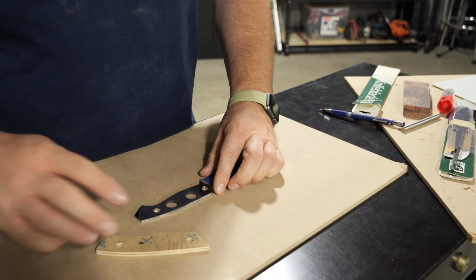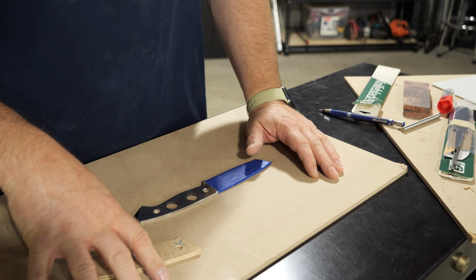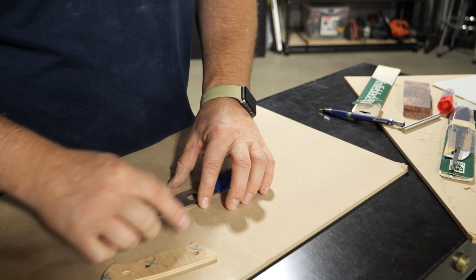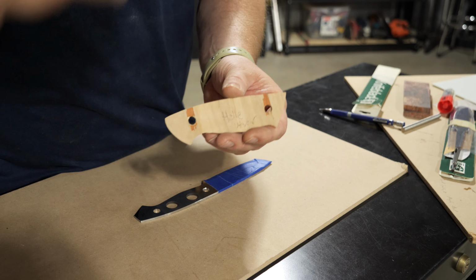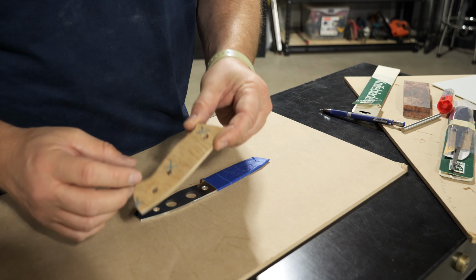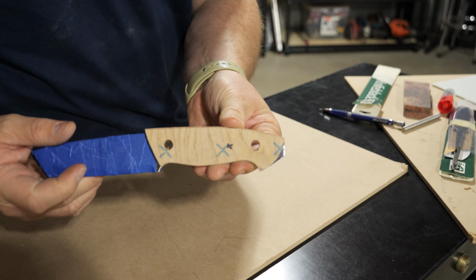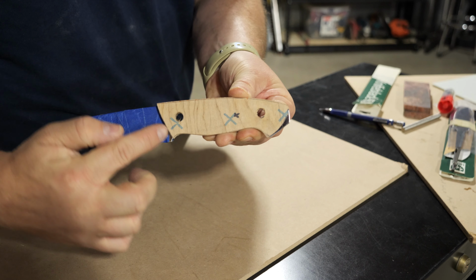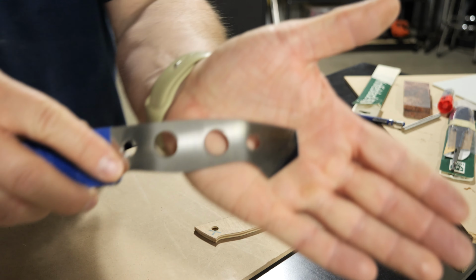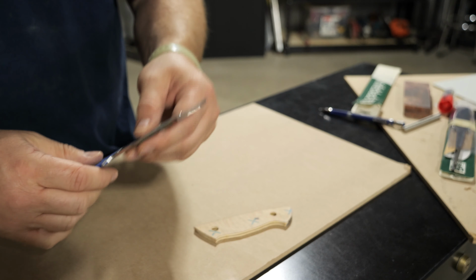To do that, if you're interested, I photographed this knife top down, made sure I was as flat as I could be, and imported it into Adobe Illustrator. You could also do it with Photoshop or some other software, I'm sure. Then I played with the shape and drew some contours the way I thought it would look good. I printed that out on paper, traced it onto a piece of wood, and made this scale outline. This will give you an idea of what I'm going for when you line the pins up. It'll be a gradual swoop in the front, and in the back it will be contoured out. I've marked the difference off with a Sharpie on the back end in that black area, and I will be grinding that off as I progress through the build.